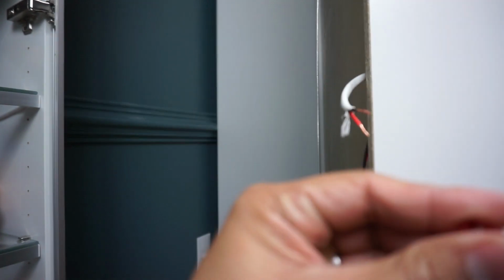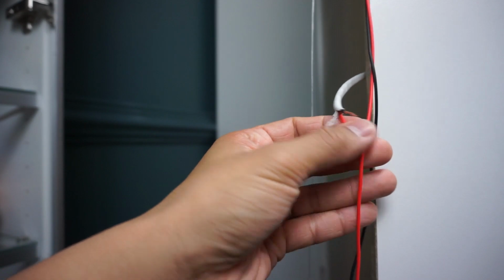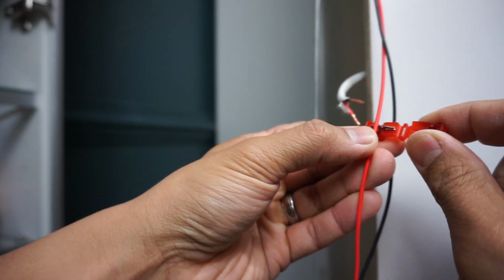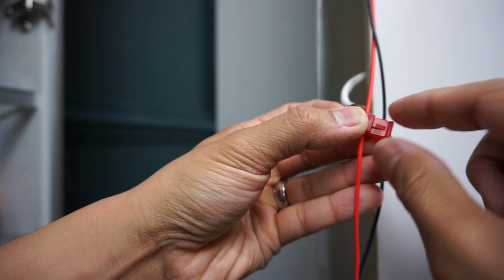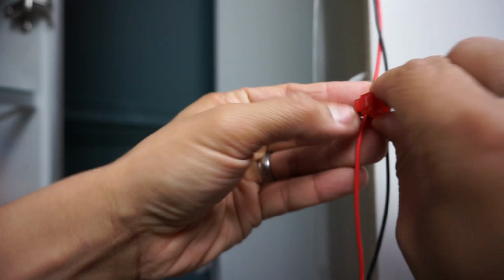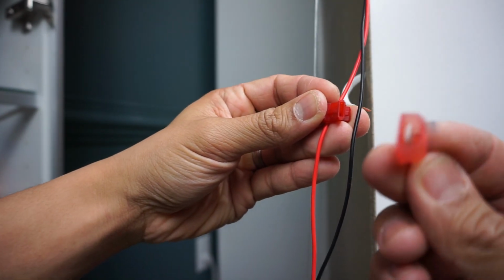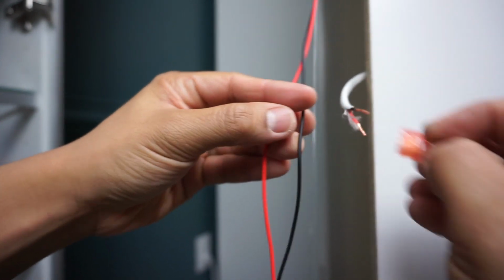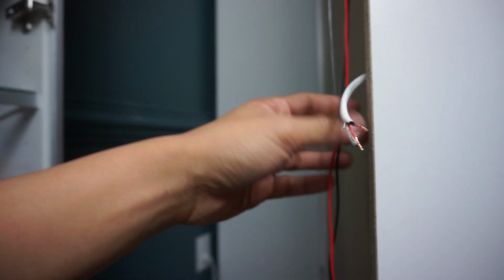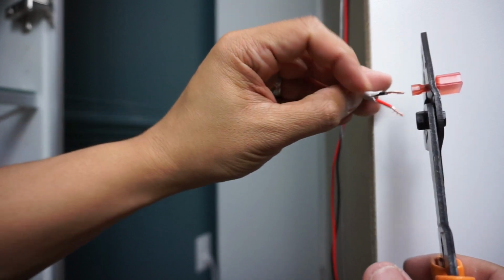And then on the other end, we're going to have a tap. So this here. So you sit the wire, so say red to red. We'll sit this in here, and I'll squeeze it down with pliers, make sure that it makes a good connection. And then there's a slot right here, a female slot that takes the male spade, and that's how we make our connection from the shelf to the main line. So since these are prepped, I'm going to go ahead and crimp this on.